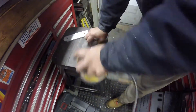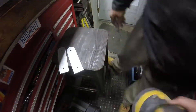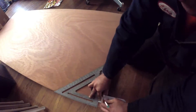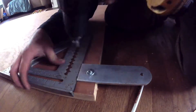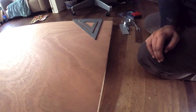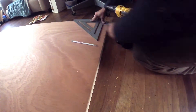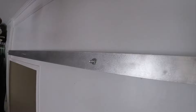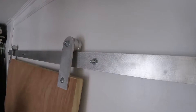With those done, just hit them with the sander as well. I realized I probably should have put two holes on the bottom of this bracket to keep the bracket from pivoting, but it hasn't been much of a problem yet, and if it ends up being a problem I can always make new brackets. With those mounted I can mount the wheels to the door. I did thread those brackets so I could tighten them and put a nut on the other side to set the tension.